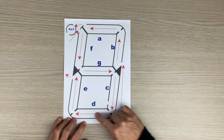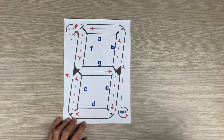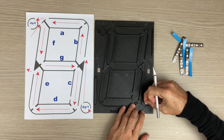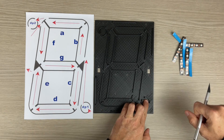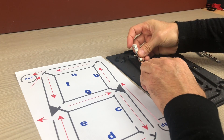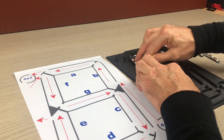I printed this drawing to make it clear what the sequence and orientation of the LED strips are. Then remove the film and attach the LED strip in the right sequence, and check that the arrow on the strip corresponds to the correct orientation shown in the drawing.